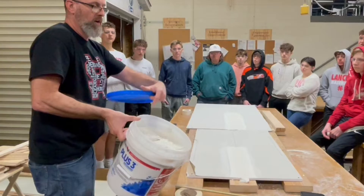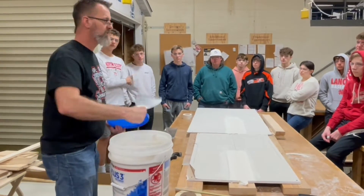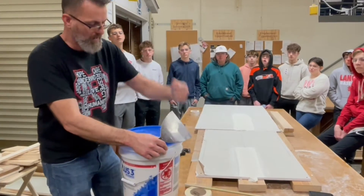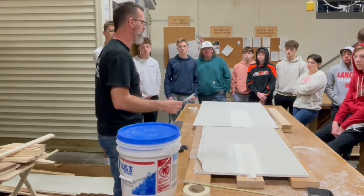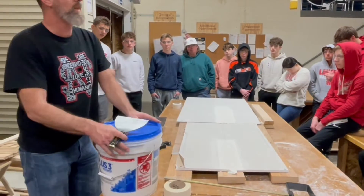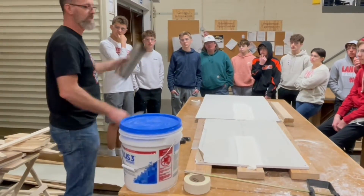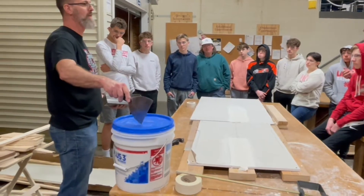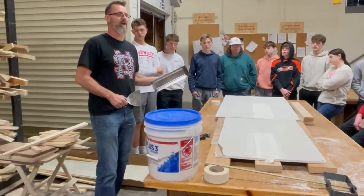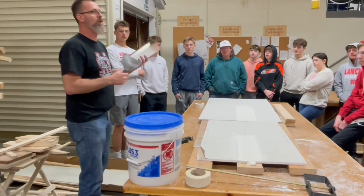All of this stuff where there are little ridges — those will dry. Everything down inside will be wet, but all those ridges will be dry. When you go to scoop this out later, you're going to scoop out all those little bits. Or if there's anything dry on the lid and you bang that down, all those fall in there. When you try to use the mud to smooth out later, all those little bits are going to drag right through. So it's important that we don't let this dry out. Whatever you don't use at the end of the period does not ever go back in here, because it's going to have contaminants. So let's say we're 10 minutes to clean-up time and you've got one joint left of mud.